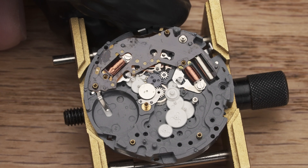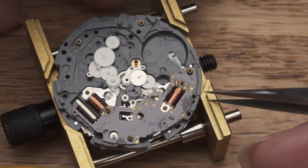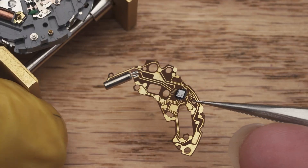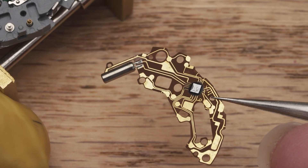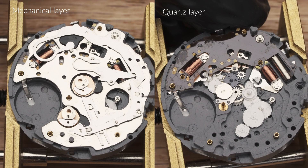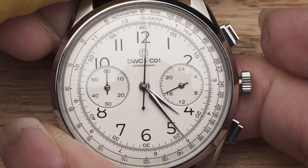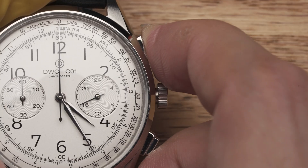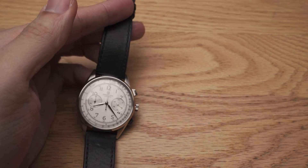Removing this layer reveals the quartz layer. You can tell by the coils and the quartz crystal, which is in this silver cylinder here. And apparently there's a circuit board attached to it. This layer outputs an accurate stream of ticks and torques, which is much more accurate than the average mechanical escapement. These two layers combine to provide the function of a mechaquartz chronograph.